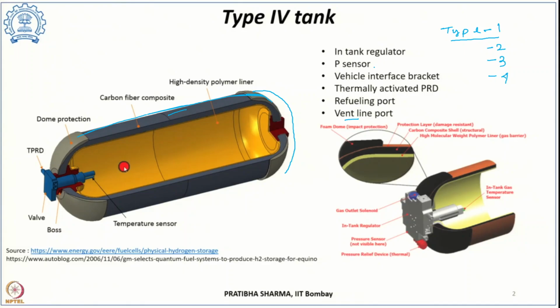Some pressure sensing device is also accommodated there because, according to the pressure, the pressure release valve and other valves will open and close. And what is the shutoff valve? Some other valves are also there, one is the shutoff valve. All these valves are accommodated here for safety purposes. The shutoff valve is also designed for safety, to stop or continue the flow of hazardous fluid from the external side, or hazardous gas coming out from the cylinder.